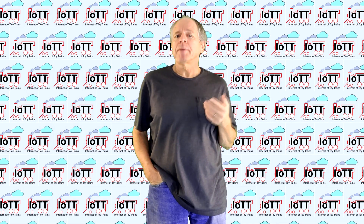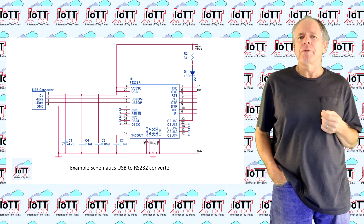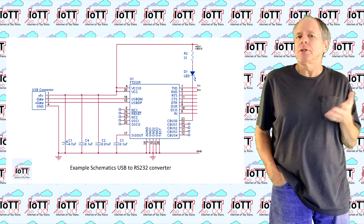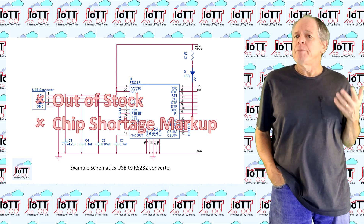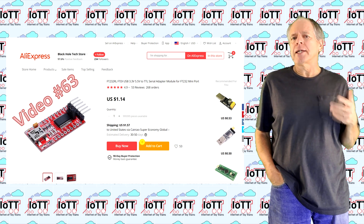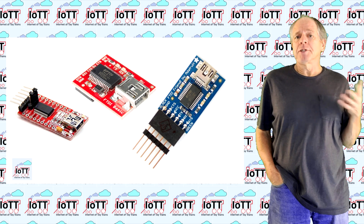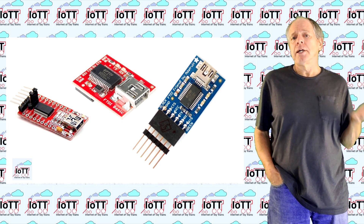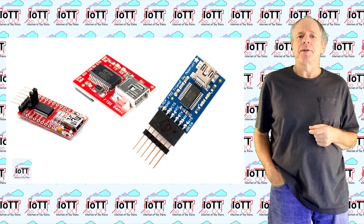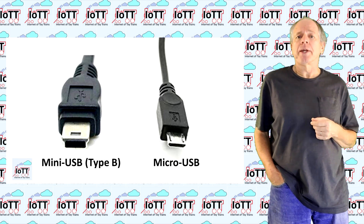To design the Brown Hat PC board I basically have two options. The first is doing a board that has its own USB to serial converter chip along with a USB connector and a few other components. I looked into that but at the time did not find a converter chip for a reasonable price, and making an expensive board was not something I was interested in. The second possibility is using a converter board like the FTDI programmer and just doing a small interface carrier board around it. Boards like the FTDI programmer are produced in large quantities, so they are cheap and the integration is easy — mainly just interfacing it to the 3.3V interface of the IoT T-Stick. The problem with that option was that all the boards I checked either featured a mini USB or a micro USB connector, and I did not like that.